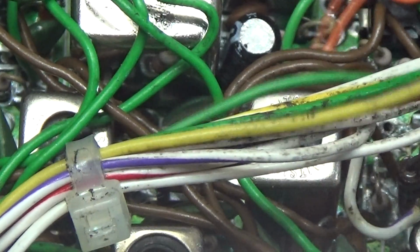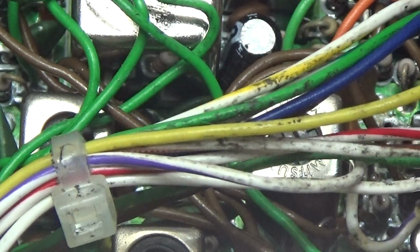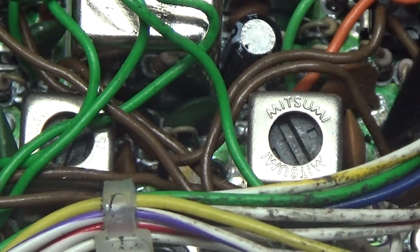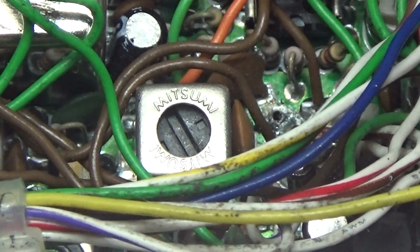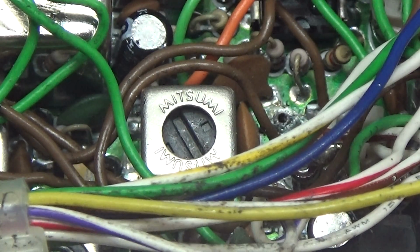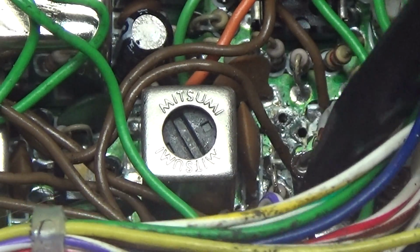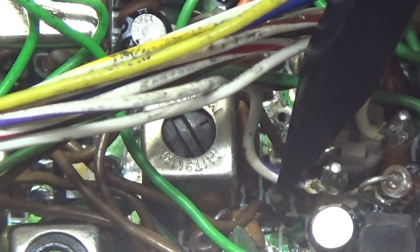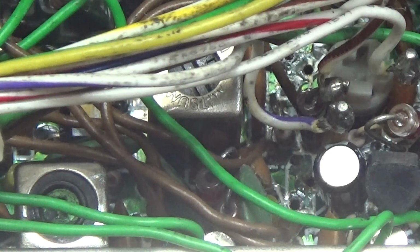and let's see if I can make it visible for you. So down here you can't see anything. That is a problem here. I mean, down here we had our S-meter driver, which we have taken out first, and then I recognized, oh, that was wrong, and I managed to find our DC amplifier for ALC, which is somewhere, you can barely see it down there, and I've taken it out as well. And when I have taken it out, then I directly have our output power.